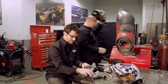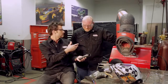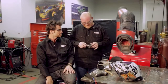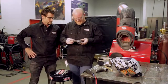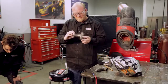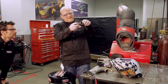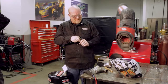This is a little test we did — you can see we welded in a bung and we pulled it. If you do your weld right, it's going to happen normally 3/16ths or so on each side — it should actually rip the parent material apart before it does the weld. You can tell this break is right on the edge of the heat affected zone, right where the base metal meets the edge of the heat affected zone. What we don't want is the weld to break. The important thing is you can see the elongation of that tube — it pulls and stretches before it actually lets loose.